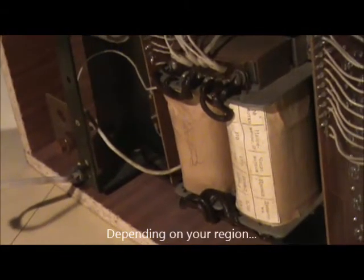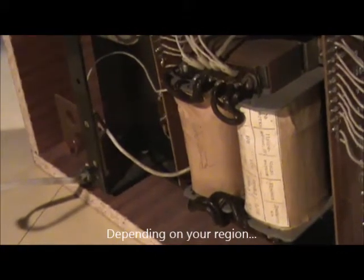Nowadays they run the service a little hotter and it stresses the components of the clock a little bit, so I think I might just leave it running off this transformer because it's going to be a happy voltage. The tubes will last longer — I won't have to rework the filament circuit to try to calm it down. If you run the filament circuit a little hotter as a result of the mains voltage being higher, things wear out quicker and those tubes start getting dark spots faster.